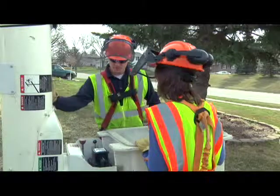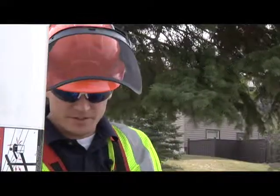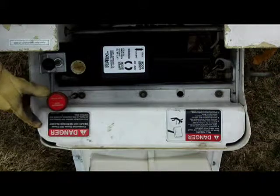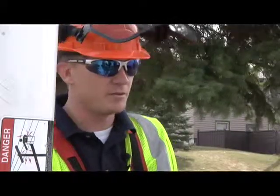When you want to operate the close boom, you want to squeeze the trigger and push up or down. There's also a safety feature in there in case anything happens — there's a hydraulic stop where we won't be able to move anymore. And then there's also an emergency power in case we lose power, which will give us enough time to get down.